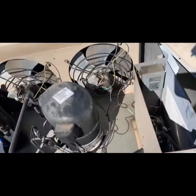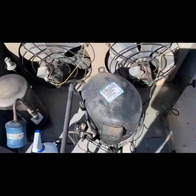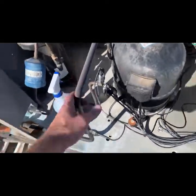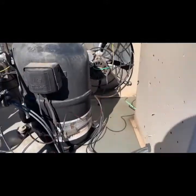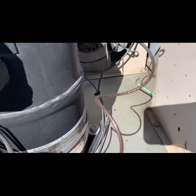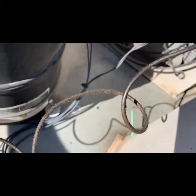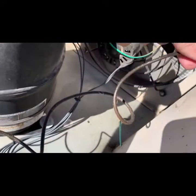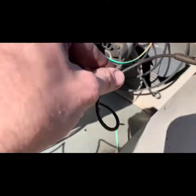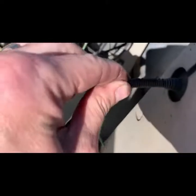Walk-in cooler condenser — I just powered it off but this has a slow leak. We've had to top it off a couple times over the last few months, so it's time to kill the monster. Just aesthetically, look at this cap tube — it is covered in oil, so you can probably guess what that means.